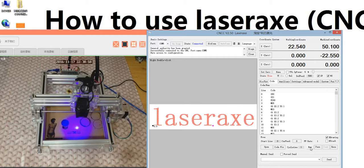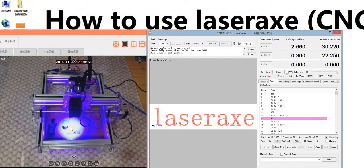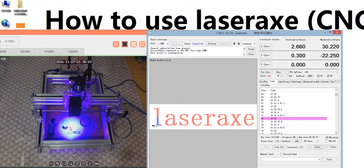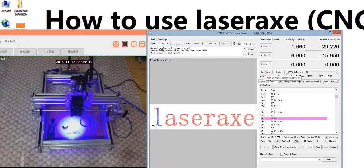So we'll run to have a check. Run. You see, it's back to here, yeah? Because you do not set 0, it will first go back to the 00 point and start here. So that's what I told you. You must set 0.